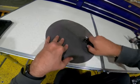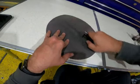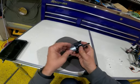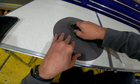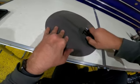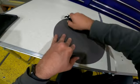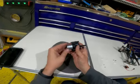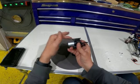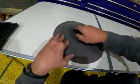It's important to pay attention to how much you're shaving and how your angle is going as you go along. I'm actually lifting up the front, so I'm only wearing out the back right now to get it caught up. See, and I did big time. So now I have this high spot in the middle and it's a little crooked. I can fix it.